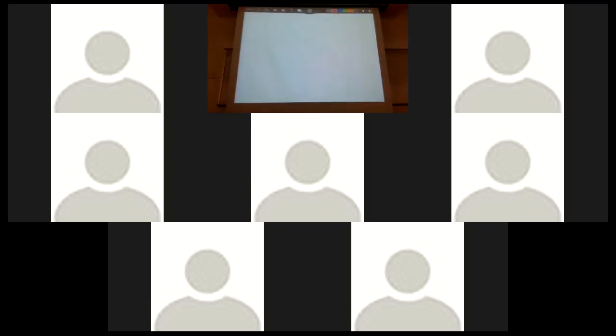So I can actually easily redraw this as: here's E1, here's R1, here's R2. So I haven't done anything fancy here. But now I'm just going to move R3 through here. So this is now R3. R4 is now here. And now here's the EMF E2. This circuit is exactly the same as the other one.